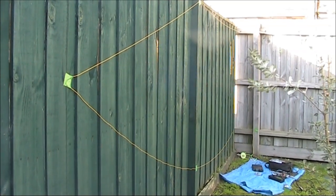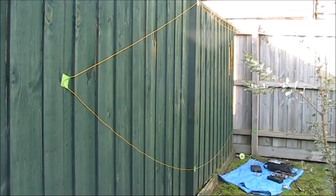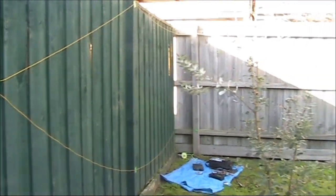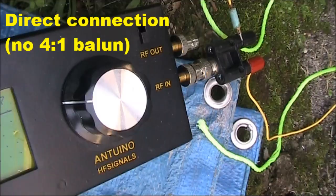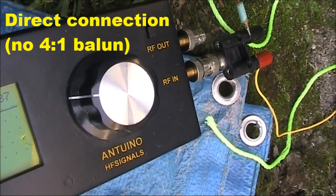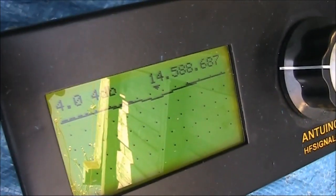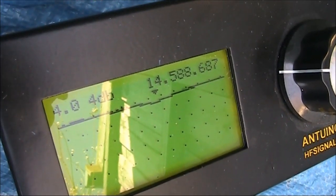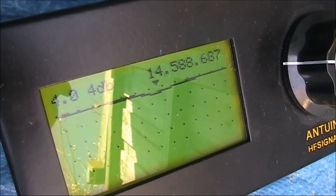Here's the erected antenna — sort of a mix between a folded dipole and a loop, an opened-up folded dipole or a squashed loop. The impedance will definitely not be 50 ohm. And if you have a look, there is a dip above 14 megahertz, but it's a very shallow one.